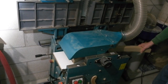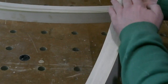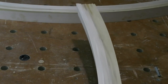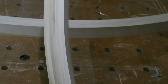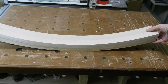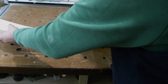Taking care to keep them flat on glue up, a half millimetre pass on each side cleans them right up. Here's the result on the good rocker — you can see the original grain and colour graduation flowing in this poplar. Very light woods like this or my favoured white beech are extremely unforgiving with glue lines; there's simply nowhere to hide. Darker woods do you many more favours in that respect, but I'm happy with these results nonetheless. On the other rocker, you could make out where having to swap out a couple of pieces has thrown the flow of the grain out slightly — this for me would be a reject on a saleable item, but for a prototype it will still be used. And here's why I take all the little steps with my forms: the two rockers are exactly the same, like I've cut them from one larger piece.